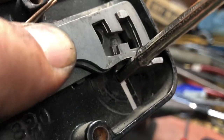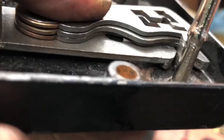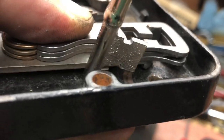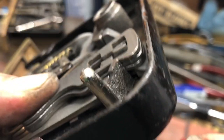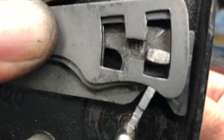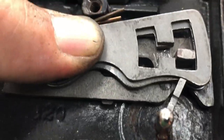So with this particular setup, it passes by the bolt, and we see the third lever is pretty much right in the middle of the key blank. Since the bolt right there is offset, see the gap between the two, what happens is you think that you're cutting one and you're actually cutting another lever. So in this particular case, the third lever is going to be pretty much right in the center of the key blank, and it only needs to go down just a little bit. But what does need to come down is the tip.